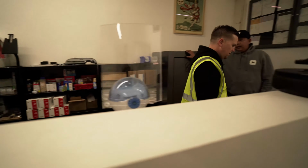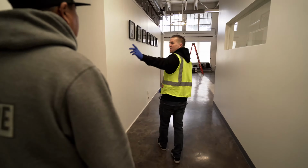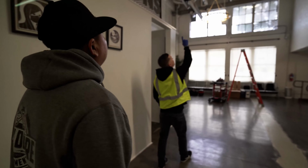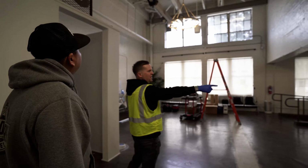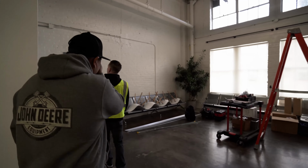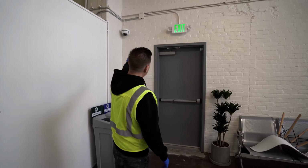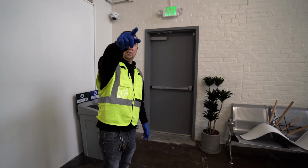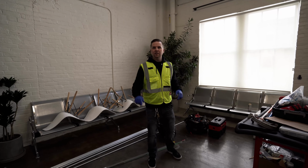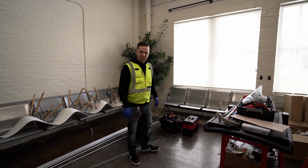Two access control wires to the doors, wireless hub, and an iPad. So you need two Cat 6 run, two of those boxes run. The Cat 6, we're gonna go up over that pole, down to the iPad right there. And we're gonna put the wireless alarm like over here, maybe right above the camera. And then we gotta get wires to this door and wires to that door for the access control. So two of the big thick white one, one each, one Cat 6 to that iPad. We can get six to the wireless alarm. Yep.